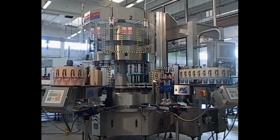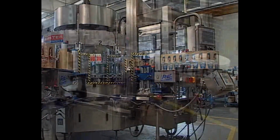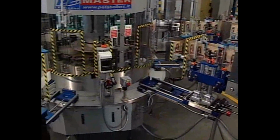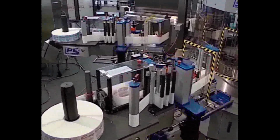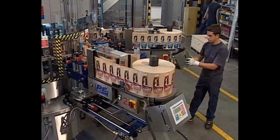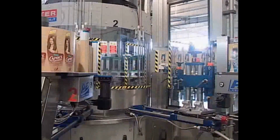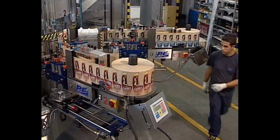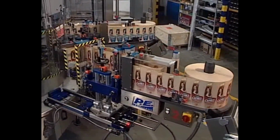What we look at now is a very interesting option: the integrated outside protective panels with pneumatic opening and closing, which are mostly used on machines featuring non-stop self-adhesive labeling systems. When the units are taken out, the passage for the picking unit is automatically closed by lowering the relevant protection to prevent any access to the machine while it is operating.